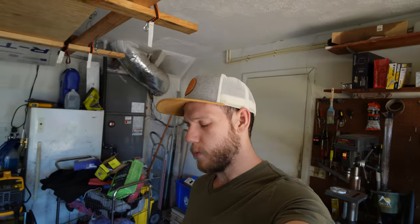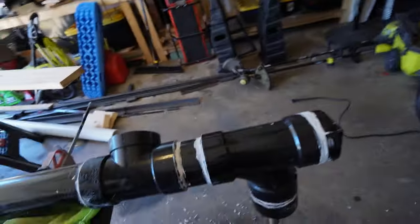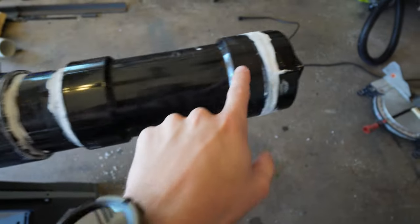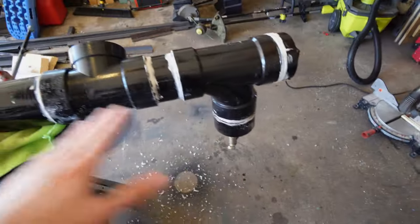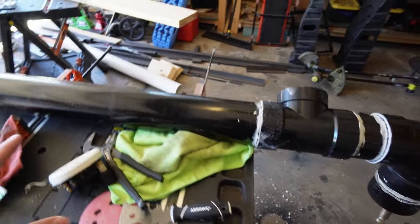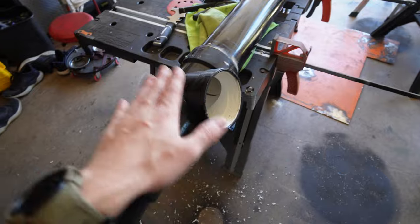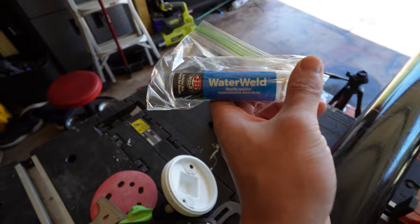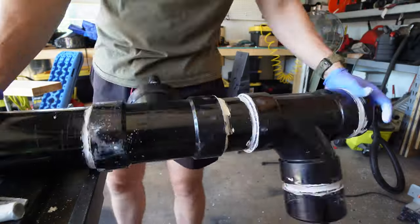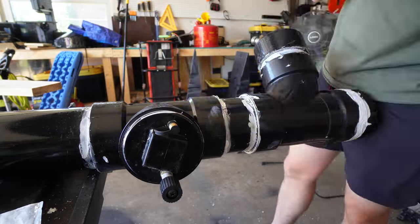Full disclosure: a few days later I went on a trip to see the solar eclipse and I needed this road shower done, and it leaked — it leaked like Boeing made it or something. I took some bathroom caulk, put it all around the seams hoping that would do it, and it didn't. Pressurized, blew some holes in it. DWV pipe is not meant for pressure, but this is schedule 40 which can handle up to 140 PSI — we're only going up to 10 PSI. So we're going to take some JB water weld, put it along every seam, and seal this thing up to pressurize it to 10 PSI with our little pressure gauge.